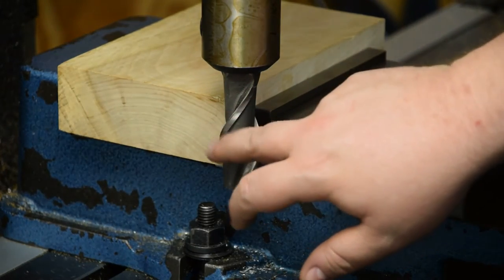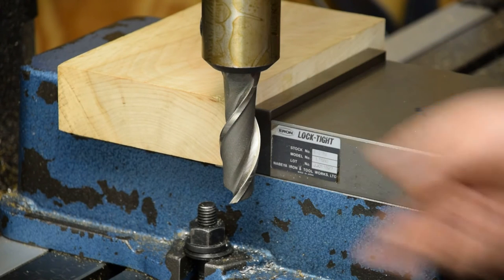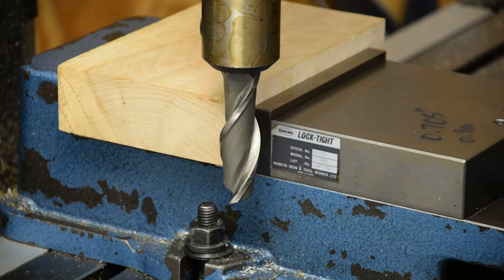This is a very sharp, high-speed steel, 1 inch by about 3 inch length of cut Putnam end mill. It's a dandy two-flute jobber. Cuts sweet. I'm running at about 3,000 RPM in an end mill holder. So it's working pretty good. Hopefully it won't blow up or chip real bad. We'll see. It didn't on the last side, so here we go.